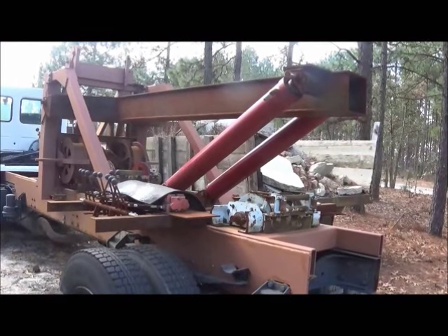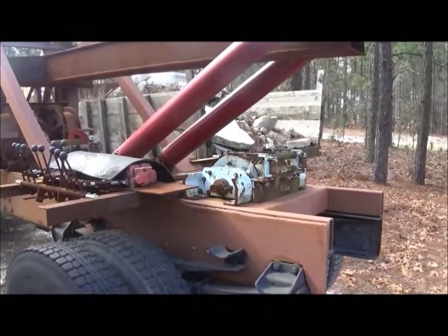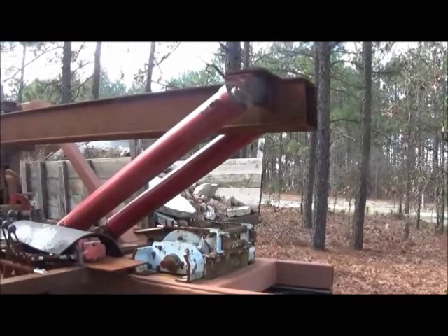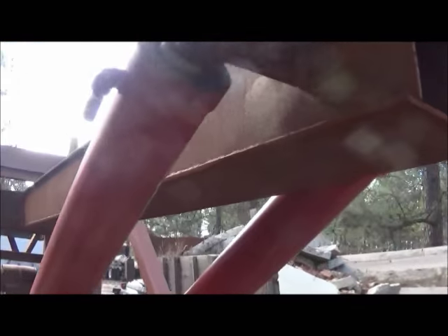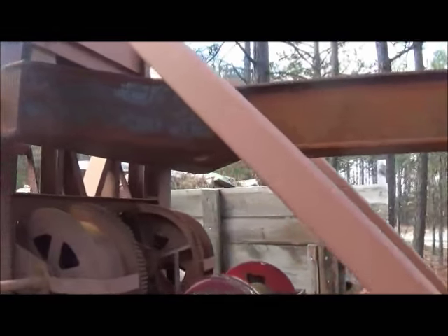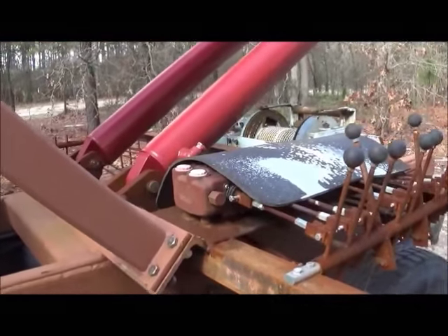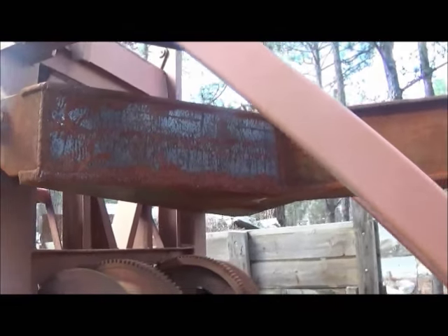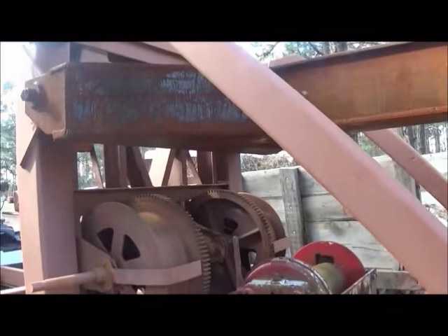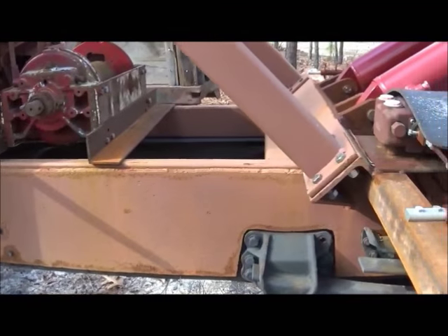Come back up a little bit where you can see it — nice unit. The inside of the boom is nine-by-nine on the ID. It's half-inch plate on top, three-eighths plate on the bottom, and three-eighths on the sides. I'll do some little supporting here and there — I'm building this one not to ever break. It's got big cylinders on it because that's what I came across. I bought the subframe, bought some steel as drops, bought quite a bit of the steel new for the boom, but just about everything else was scrap that I had.